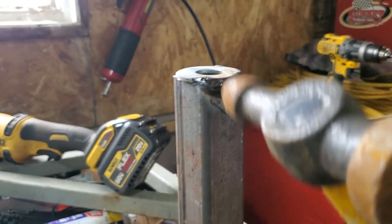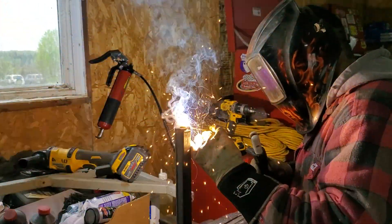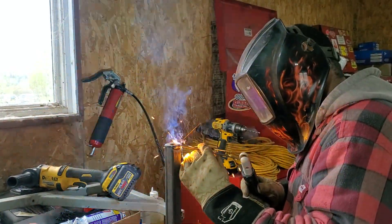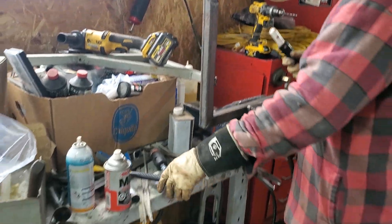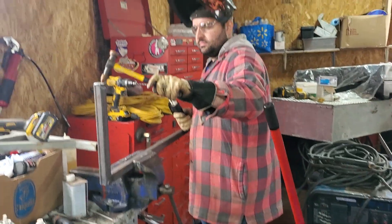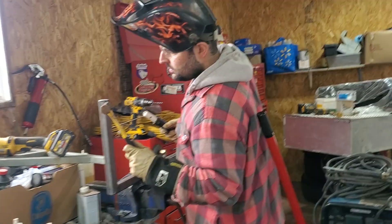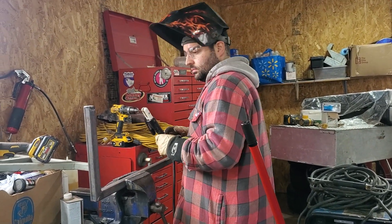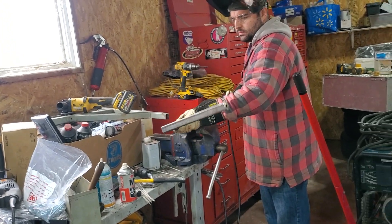Not a bad weld. We're just making these dirty handles to go on there. When it sticks it doesn't load up like a transformer machine — it shuts down. Look at the re-strike on that Hobart rod — nice stuff. That's E7014, if you guys look that up: it has the strength of 7018 but it's not a low-hydrogen rod, so you don't have to go through all the hoopla to store it. You can leave a box of it in the back of the pickup truck and not worry about it taking on hydrogen.